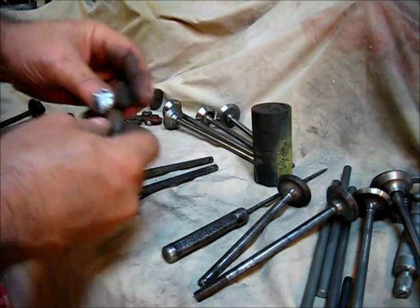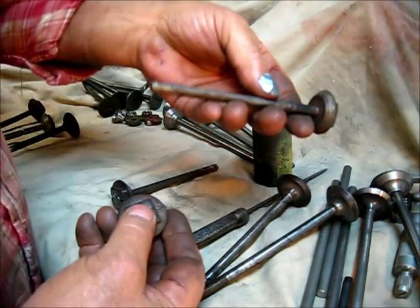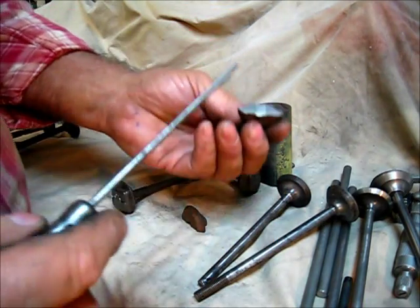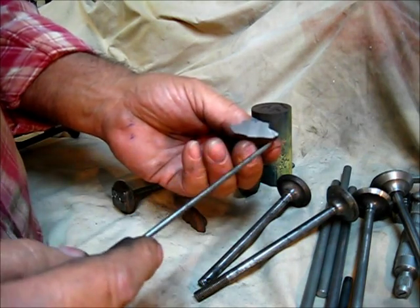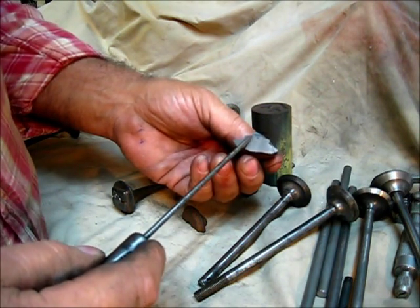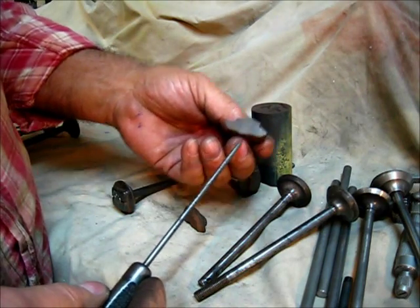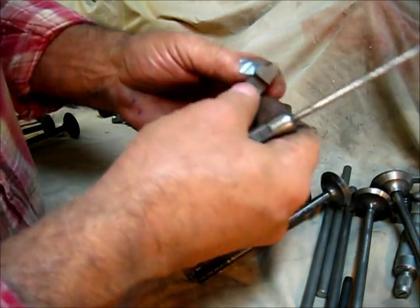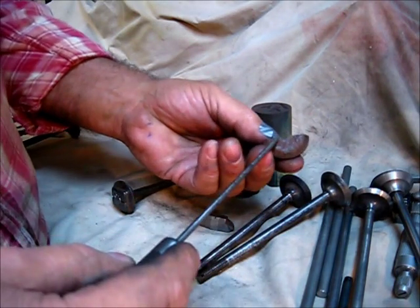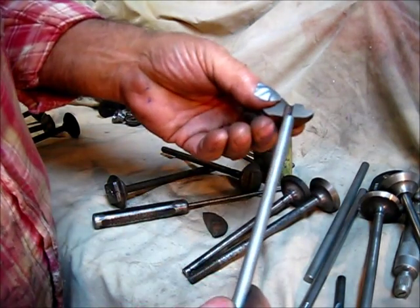In order to have a blueprint to work by, I took one of these valves and sawed it in two where it came off of the stem. If you observe, this is the old stem that's left in it — it's two different materials and you can see the shininess of that stem. It's got a taper right there; this is smaller than the bow stem size, so there was a little shoulder effect right here. With the valve stem removed you can see the taper part and where that shoulder was when the valve stem was made.